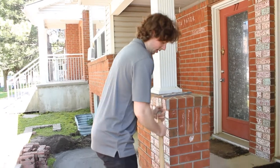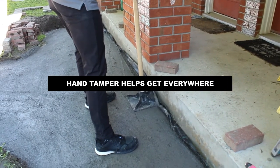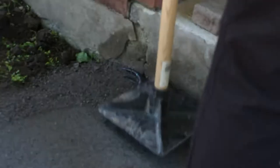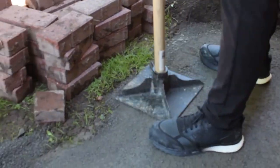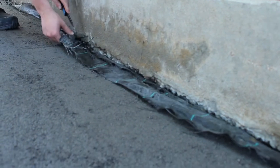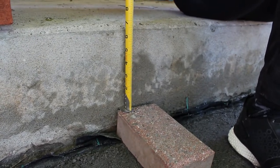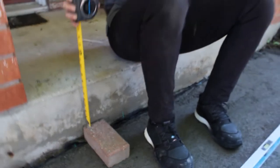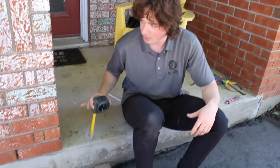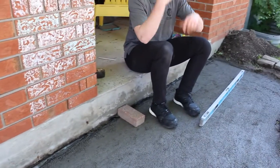I'm hand tamping right now, because the plate tamper didn't get everywhere, so I'm using the hand tamper to get everywhere. I'm just trimming this fabric out. We're very close to our seven-inch mark — just a bit high here, but that's fine. We want it to be between six and seven inches, closer to seven. Then we add a little bit of stone dust and we'll probably be near six and a half. Some of these areas are a little lower as we're sloping it down and away.